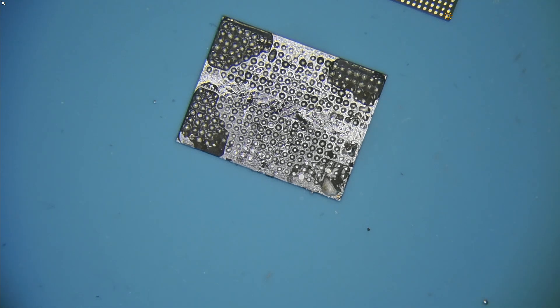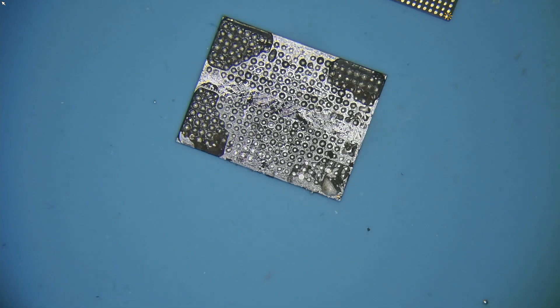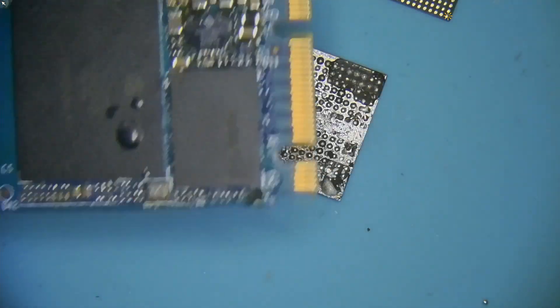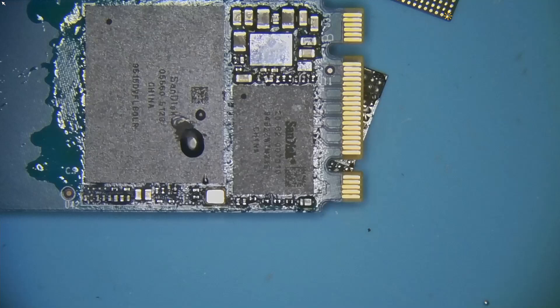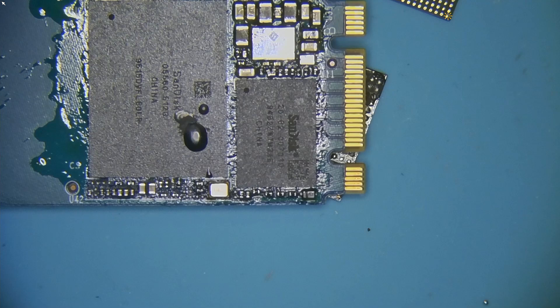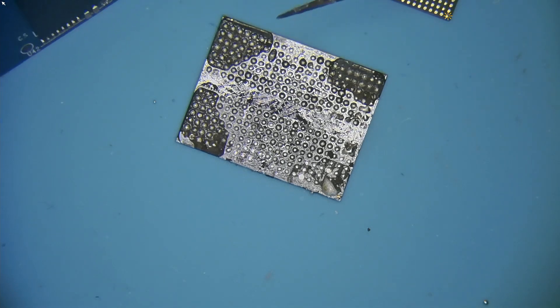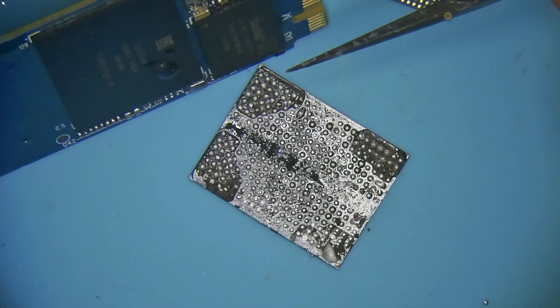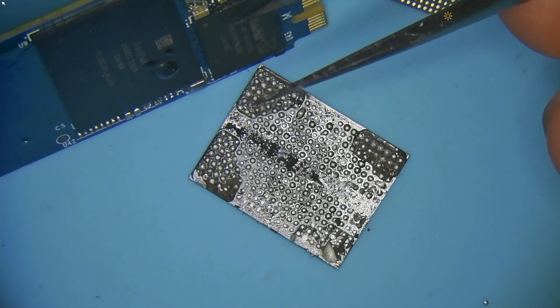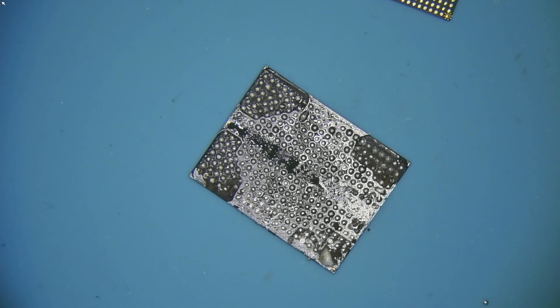But if they don't work, that means they're just not meant for each other and there's nothing to look forward to if the controller is dead. The reason I want to reach that conclusion is because this SSD I've been working on for a few days is still nowhere close to functional. My guess is that this controller was brought so close to the ground that something got shorted and burnt out. If it's burnt on the inside and it doesn't work, and it's unique, then the data is gone with it.